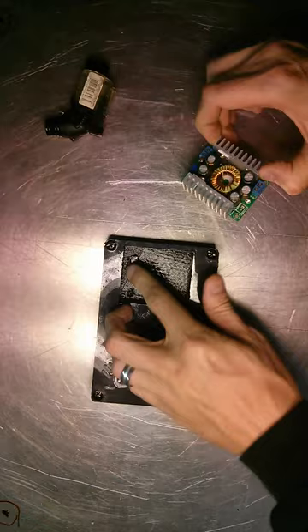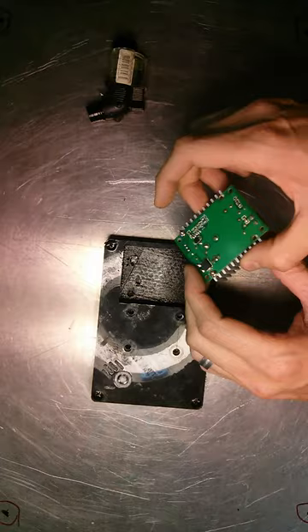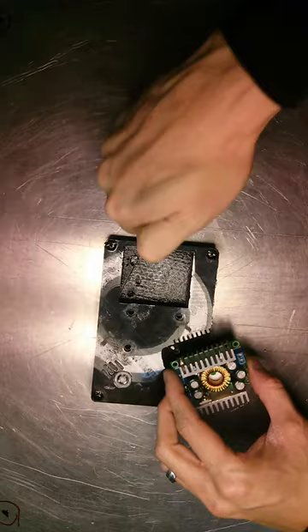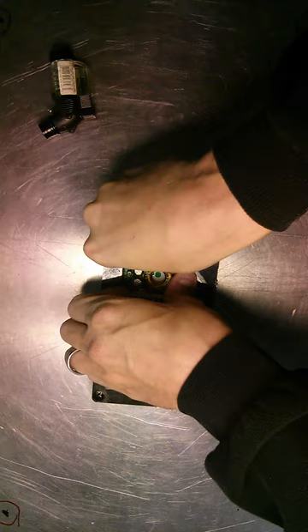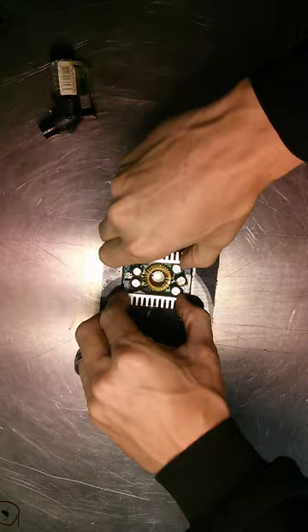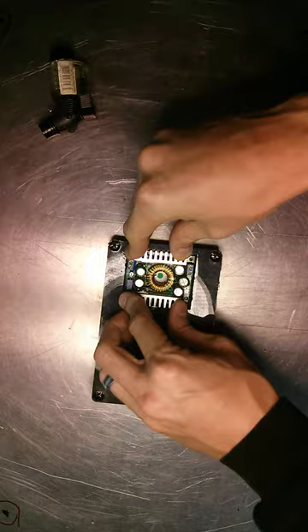I feel that sink in there. Oh yeah, that's beautiful. Need to hit it a little more over here though, because those other pins are — I should probably put those screws back in too, but I can deal with that later. I had to loosen up the screws on the bottom of this power supply because the manufacturer was kind of sloppy about how they put these heat sinks on and they were crooked. So my modeling measurements were made off of another power supply, and these two edges of the heat sink fin were splayed out a little more than spec, so I had to cope with that. But that looks like it may have done the trick.